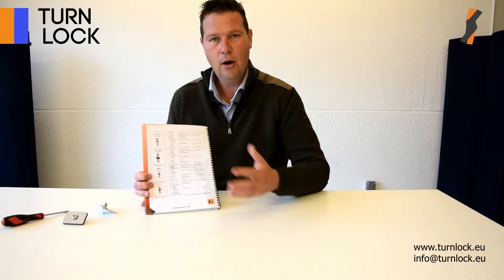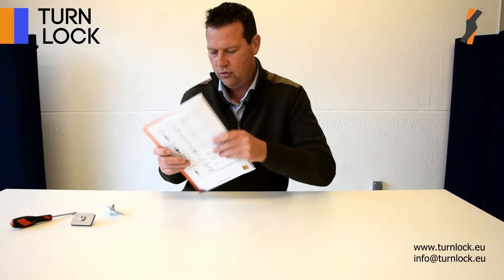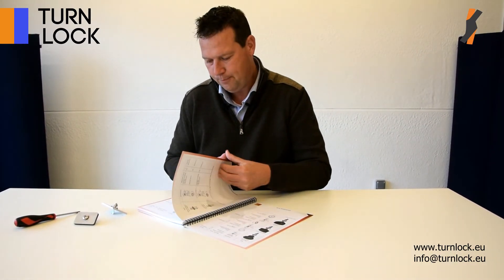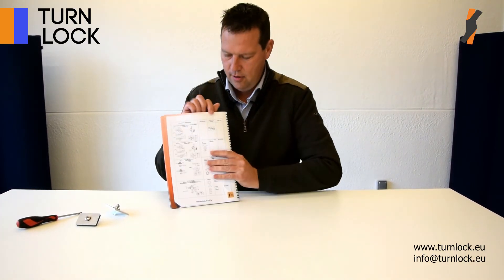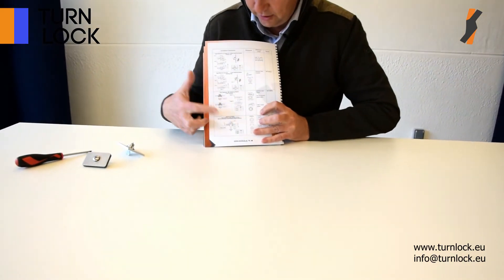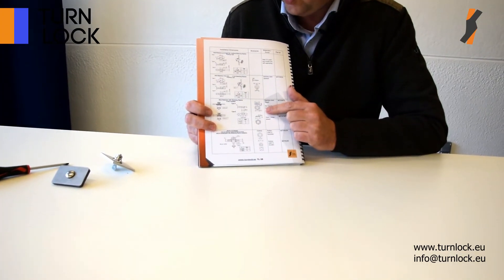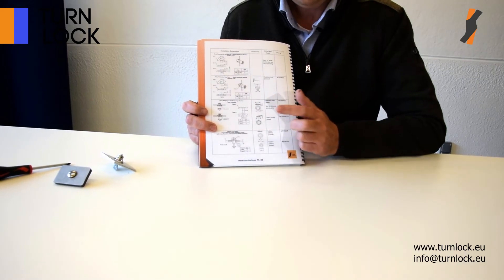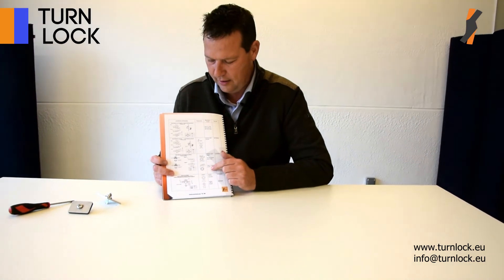Now you have the stud and you have already selected your receptacle. Don't forget to go to the section of the retaining washers. Review your design options and select which retaining washer you would use in your application. Over 80% of people forget to specify the retaining washer — don't forget it.